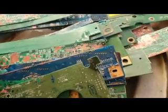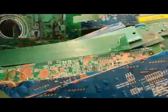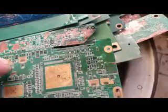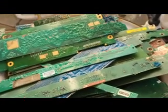What sometimes happens is it seems to tarnish with the HCl. See, they look a bit funny, but they'll come straight back to where they were once they're in the nitric acid. It's just an optical illusion, there's not actually anything wrong with it. So, some of them look like they're okay, and some of them seem like they've gone a weird colour. But it doesn't matter, there's nothing wrong with it, it'll be just the same. Some people have panicked and said, oh, what have I done to the gold? You haven't done anything to the gold. It's perfectly fine. Okay. So now I just wait for this last batch to go. And then I can take them out and get ready for nitric acid.